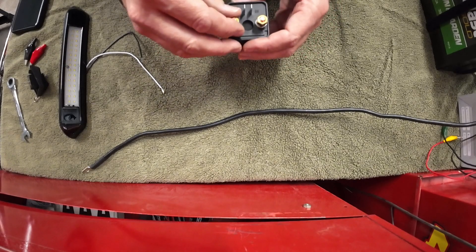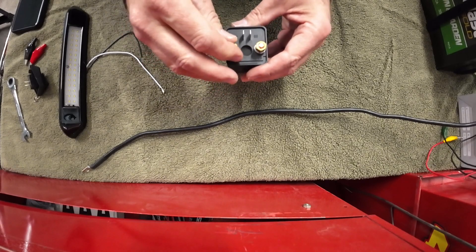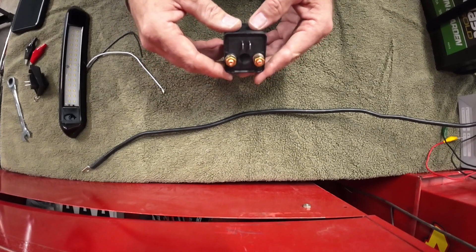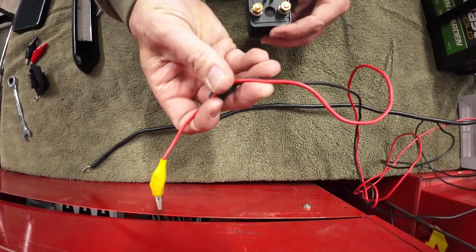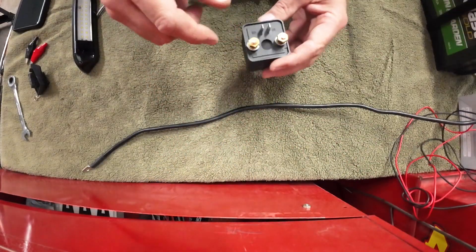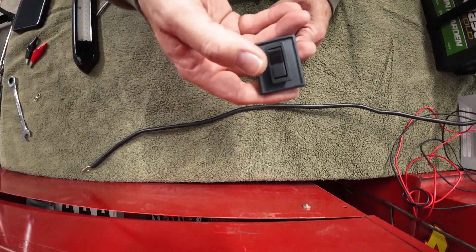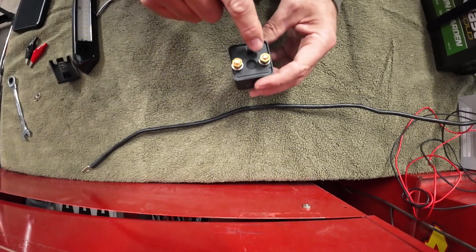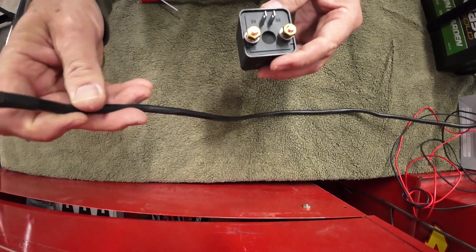A winch can take 3, 4, 500 amps — that's a lot of amps. My inverter pulls 160–180 amps. A compressor is going to pull a lot of amps too. So this relay allows you to use small wires and run them up into your cab into a switch. You can put a switch inside your cab to turn it on and off. That's a small wire — a small current that closes a bigger switch allowing bigger wires.